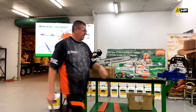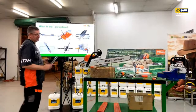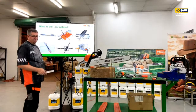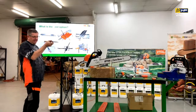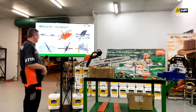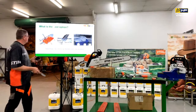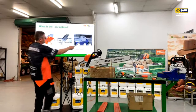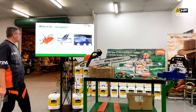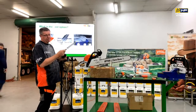So does that mean you've got to do the depth gauge first then? No. You can't do the depth gauge until you've done the cutter. Right. Because the cutter, because it's going backwards. But you said it was leaning on the depth gauge one side? Yeah, it's just getting the height of the file right. You need to address the depth gauge afterwards. There's a picture there where it shows that sitting on there, and that keeps it at the right height. But after we've done that sharpen, you need to then get your tool and do your depth gauge